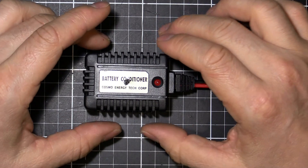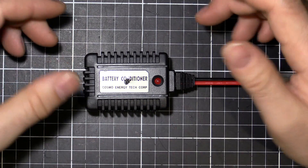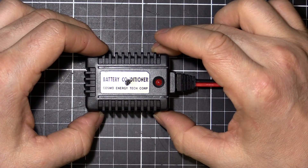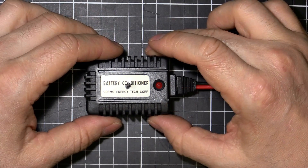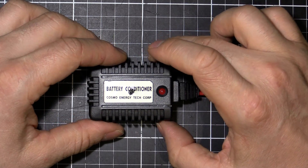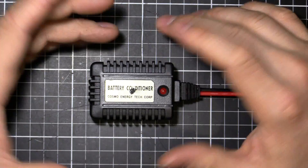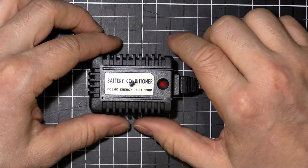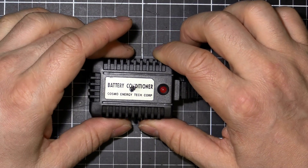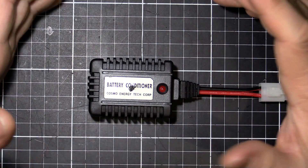What they do exhibit is general wear and tear. Under high use, like in a remote control car or a battery drill, nickel cadmium batteries will last about 1,000 charges — maybe a bit more with current tech. As a rule of thumb, about 1,000 to 1,500 charges, then they just wear out. If you treat them really nicely and discharge and charge them gently, you might get 2,000 to 2,500 charges, maybe more, but they will eventually wear out.